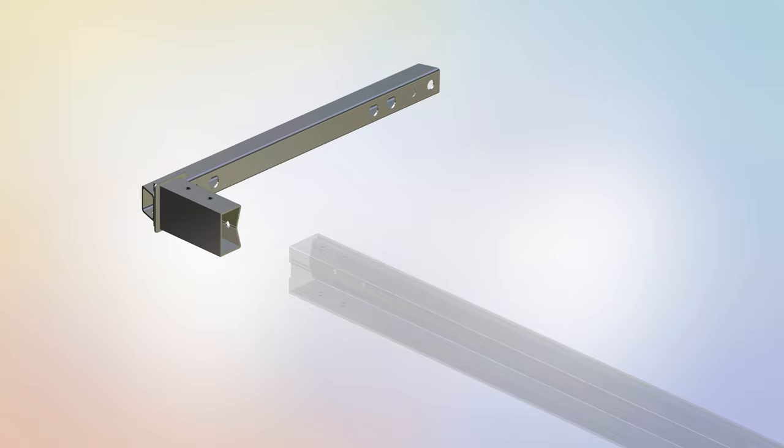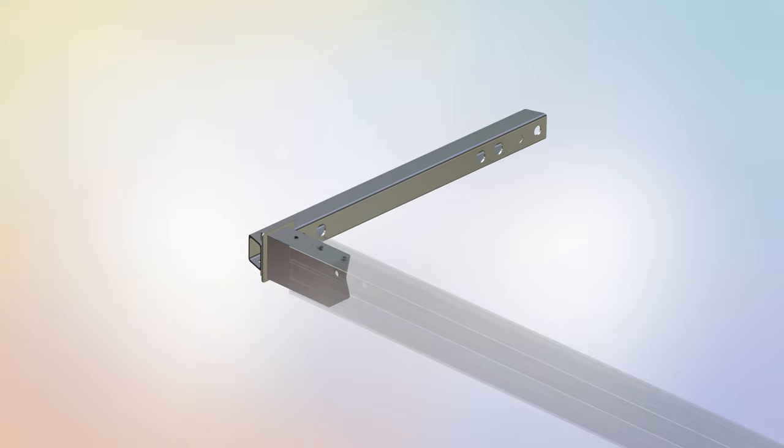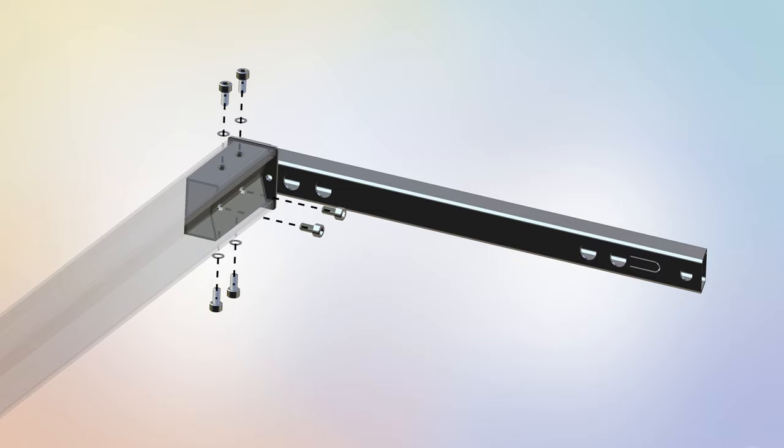Next, locate the lower connecting rail, part F. Lining up the holes on the inner frame and sides of the bottom section of part G, slide part F rail to the bottom of part G as shown. Secure part F to part G using six part R bolts and four part V washers. Two part R bolts and two part V washers are to be tightened to each side of part G, and two part R bolts will be used on the front inner section of the main frame.